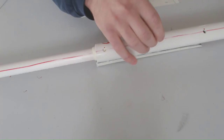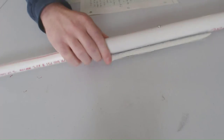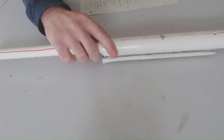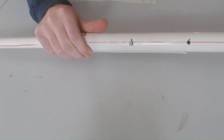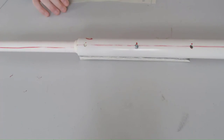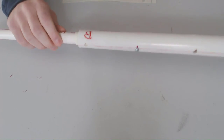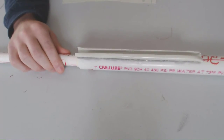The settings of the telescoping legs is changed by inserting a screw or a bolt into the holes that are pre-drilled on the rod. The 2 pipes line up by use of a single line, a straight line across them, and this allows you to find your pilot holes. Once you put in a screw, it locks the leg in place and then it can no longer move. A good thing to note is that the holes are placed on the outside of the tripod during assembly. This allows for easy replacement of the screws and easy setting changes.